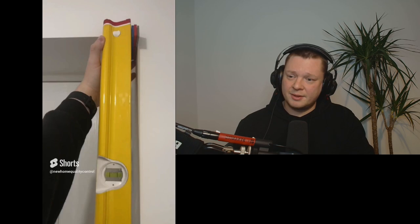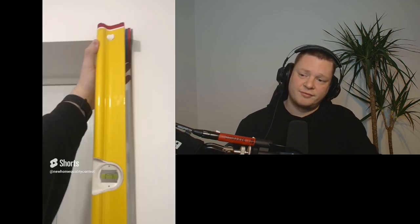This door reveal is 15 millimetres out of plumb. How they would fix that is the top of the reveal needs to be plastered and plasterboarded — they'll feather it out, as it's called.